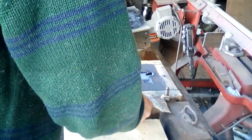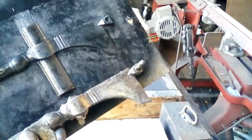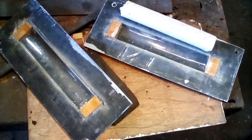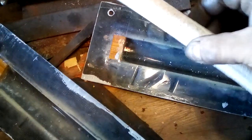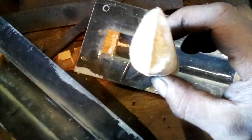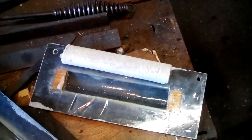To compare this to the pattern — there is the pattern. Here's the core box and a sodium silicate bonded sand core. This is the part that you make to create the eye in the tomahawk. It's sand and sodium silicate mixed together and pressed in a little fiberglass mold that I've made up, and you shoot a little carbon dioxide in there to cure it. It's bonded together, but not so tightly that you can't easily break it out of the eye once you're done.